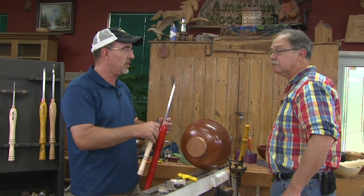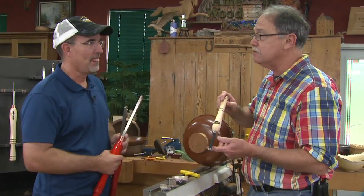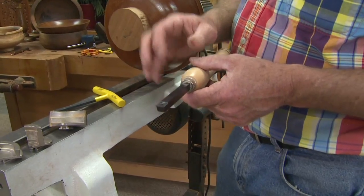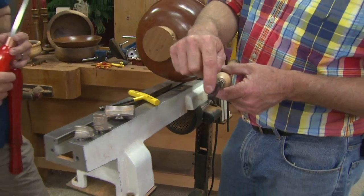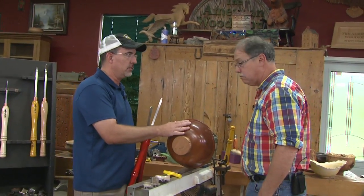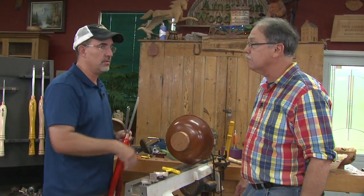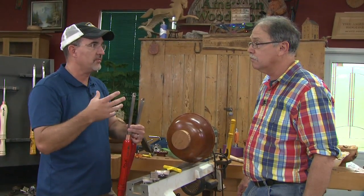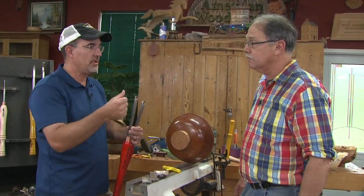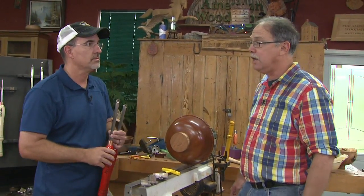We offer a few different sizes of tools, from small all the way up to large — just like you have small and large projects. Big bowl, big tools; little bowl, little tool. This small one is great for pens — crank it up to 1800 RPM and watch the wood melt away. You'll never lift the grain with that sharp carbide. When it gets dull, loosen it and rotate it 90 degrees for hours more of sharp cutting. Your project can't be any smoother than your edge. In the past your edge was totally dependent on your sharpening skills, but with Easy Wood Tools we provide perfectly sharpened factory edges — like a replaceable-head razor, so you can focus on your art form.